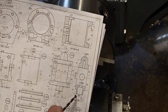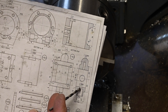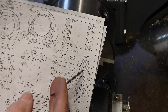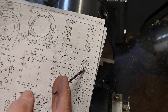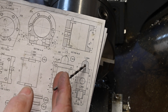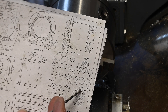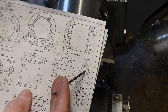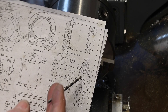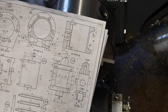I've gone most of the way through with a 4.8mm drill because I've got to ream this to 5mm once I've done the pocket. Then I've got to go through here with 3.5mm — this section is drilled with 4.8mm and then I'll ream it out to 5mm later. Now I've just got to go into this bit with a 3mm bit and then I'll ream that to 3.5mm later.